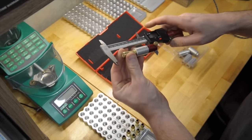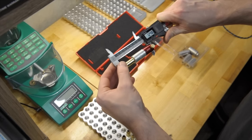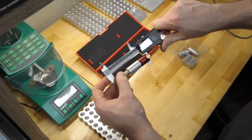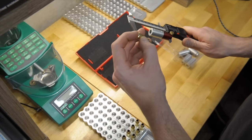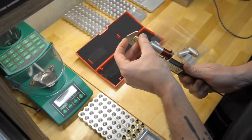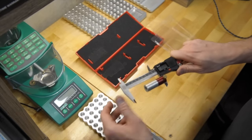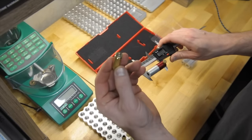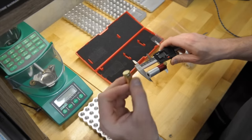This is just going to drop in here, measure on that 375 line, and this is going to give us 1.2485 on this case. Spin it around a couple of times and that's not changing. One thing to look out for when you do this is your primer. If your primer is raised so that it sits and teeters on this, you're not going to get an accurate measurement — which is another reason I don't love this method. You might get an extra thou or 2 thou out of that lip on your primer.